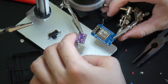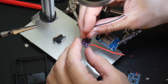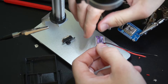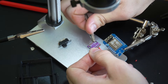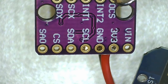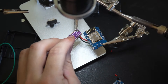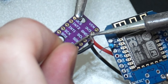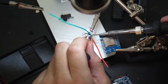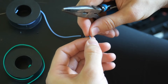Moving forward, I'm going to solder our 3v3 into our IMU, and then put our negative in the port just next to it. Next, flipping our IMU around, I'm going to take a small wire and bridge out the ground and the SA0 ports on our IMU, as we're going to use that ground connection later to attach to our switch. Securing it to the SA0, I'm going to then put it into the ground.